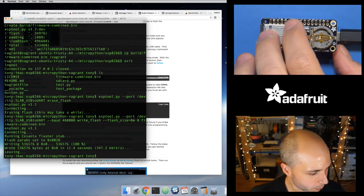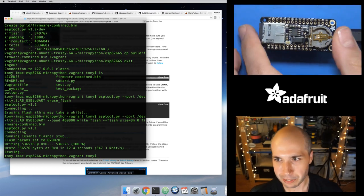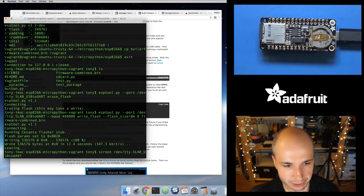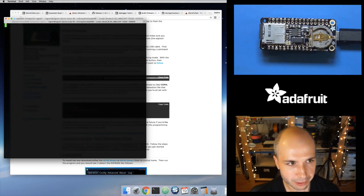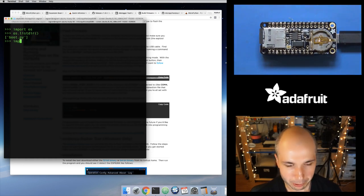I'll press the reset button to reset the board after flashing. Let's connect to the REPL again — Silicon Labs device, 115200. Let's import os first, run os.listdir — there's a boot.py, and we see for sure there's no sdcard.py. But if I import sdcard — hey, that worked! It's actually pretty quick — boom, it just loaded. Before when I ran that import command it was a little slow because it had to load the text file with Python source code and convert it into the bytecode that MicroPython uses. With this frozen module, it's stored in flash memory as bytecode, so it can import it very quickly without doing any of that conversion.